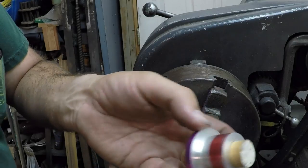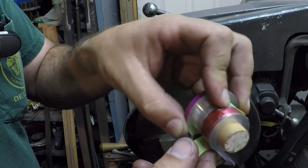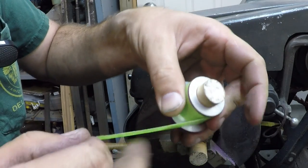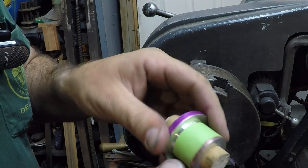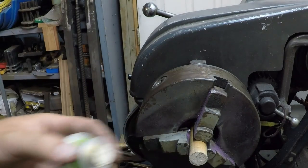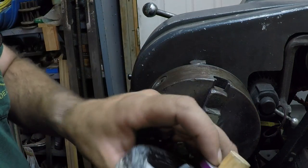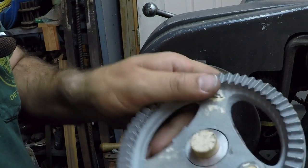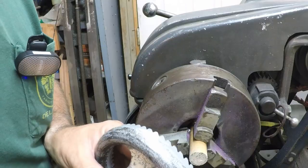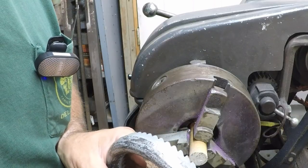We got the wood trimmed down — this is a little thin, I'd kind of like it to fit more or less in that bore pretty snugly. I found a roll of tape that happened to be laying over here, so I'll lay some tape around here and we'll see how well this fits in the bore. That's probably pretty close — how many times do you ever eyeball a press fit on something? That's actually tight enough to hold this part. Originally this has a square head bolt type set screw, but I don't want to use that for this. I found a modern socket head screw.